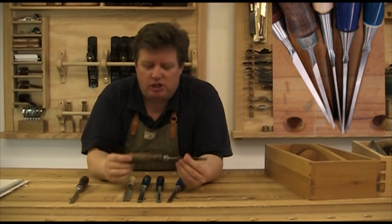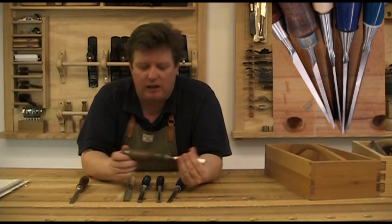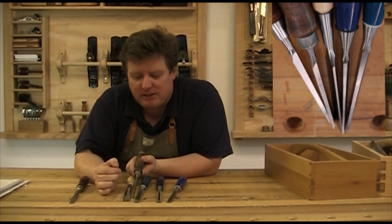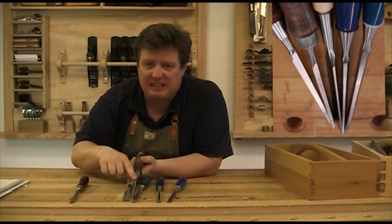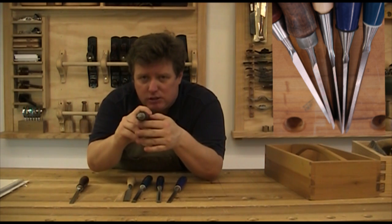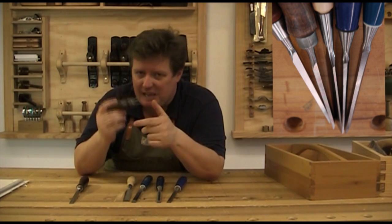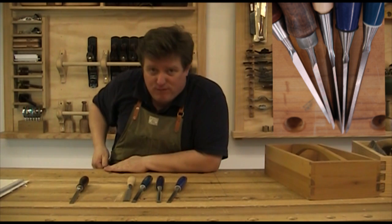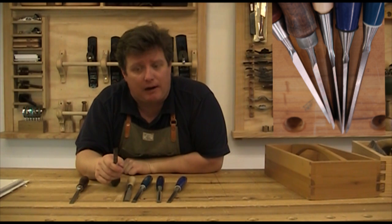Now, this Czechoslovakian chisel, and I'm not a salesperson for them. The reason why I bought it is if you look at the side of it, they have spent extra time in the manufacturing process to grind down the bevel so it's very narrow and it is even all the way down. With this tool, I can actually slide it into gaps farther, and I don't have to worry about the side bevel raising. Now, the downside is there is less metal in the chisel, so I can actually flex it a little bit. But I use that to my advantage when I'm trying to smooth multiple parts out.